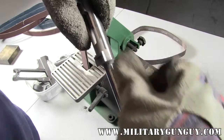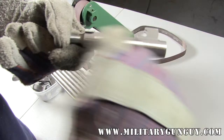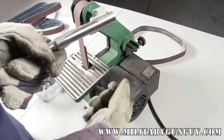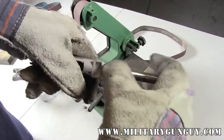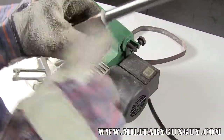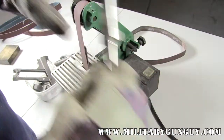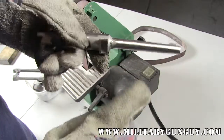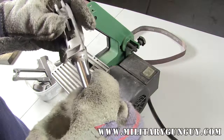You can also get in here with a Dremel, but I don't like using Dremels in areas like this because you can't necessarily control the amount of pressure unless you have a Dremel mounted in a drill press. I did nick it slightly in this area — no big deal, I didn't cut into the metal much. This can all be finished by hand because I want to maintain that very sharp barrel contour. The mark of a crappy rebluing job is that all your edges are rounded off, your screw holes are dished out, and your markings are gone.